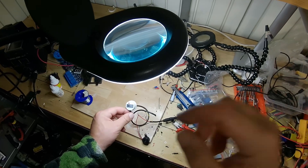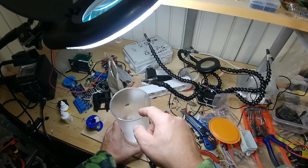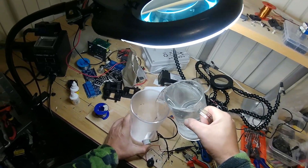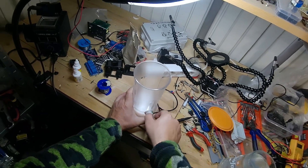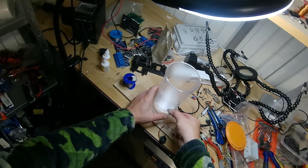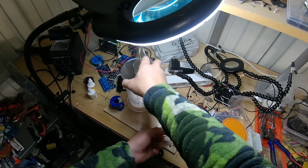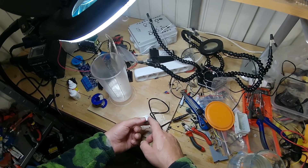You may use a relay for a water pump. Black cable is minus from power supply, brown cable sensor is plus, blue is minus, and yellow cable is output for your buzzer or relay for water pump. I show you some example with water. This sensor receives capacitance from air, but water has an absolutely different capacitance. Material thickness may be up to 15mm and the sensor still works.